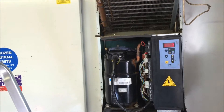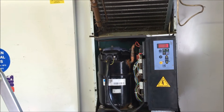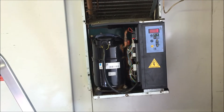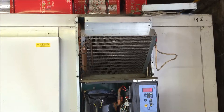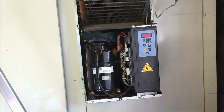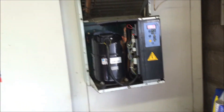Just a little tip: when you get to a job like this and it's warm at the compressor and the compressor's off, don't just presume the compressor's dead — it just might be a bit hot, which is what I was hoping. Just do a little bit of investigation work. Nice easy one. Half five now, so I'm going to watch it come down, pack up, and go home.